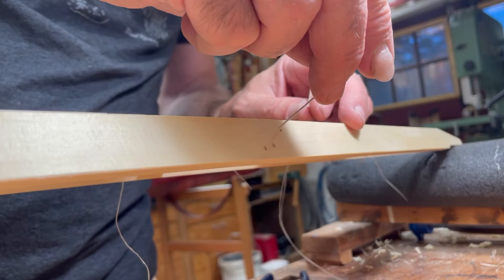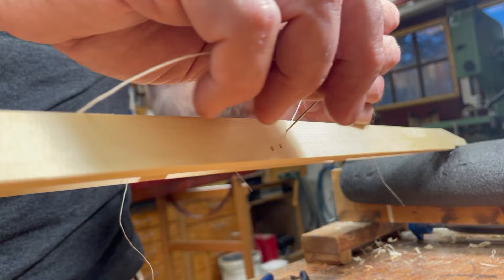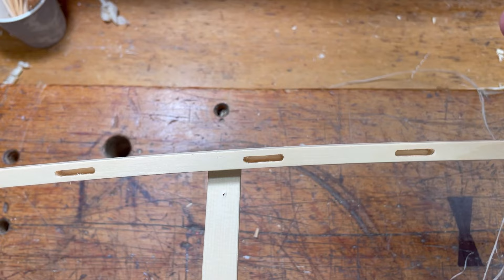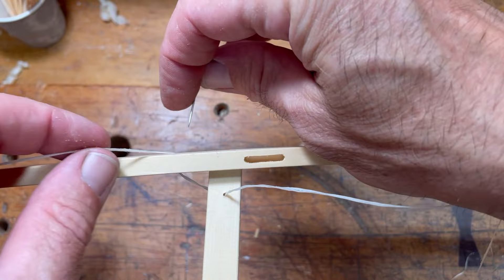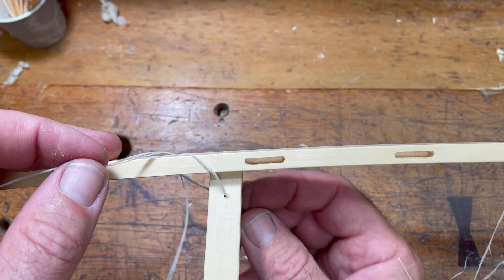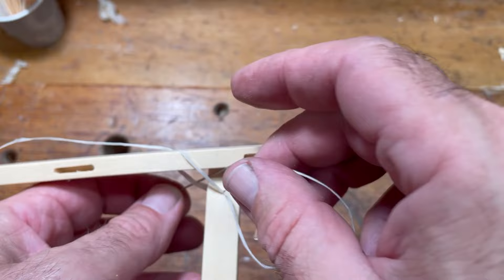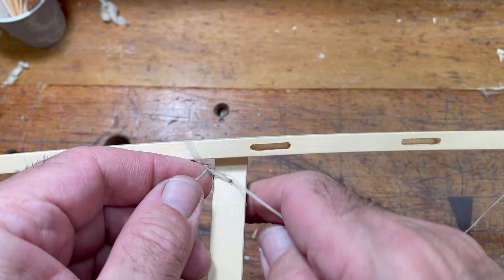Once the dowels are fitted and trimmed off, it's time for lashing. First I need to drill some holes — I use nominally an eighth-inch diameter drill bit. These holes are drilled through the deck beam two fingers' width from the inside of the gunnel, and they're drilled through the gunnel one finger's width up from the bottom and two fingers forward or aft of the deck beam. Then we start lashing. The mantra I have for lashing, with the gunnel inverted, is in from the outside and up from the bottom. We pass that lashing through three times, leaving it just a little bit loose — we don't pull it tight. Then we do three half hitches off each side of that wrapping. To make them secure, I either pass my needle back through the bundle and do one more half hitch to lock it off, or I'll just tie the two ends together.